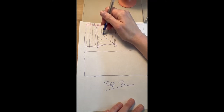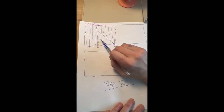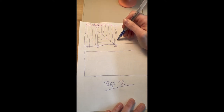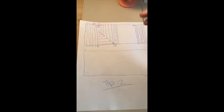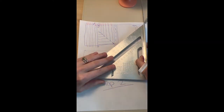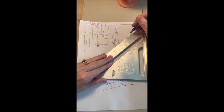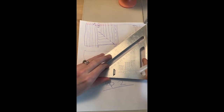Once you've figured out this section of the pattern it's all going to be 45 cuts — just a reflection. You're going to do the same thing just reversed. You'll have your four lines, then your two going back towards the middle, and then your other middle section of six facing outward. Once you have one section of the top drawer it's the same but reversed for the other side, and the same for your bottom drawer. I usually go through and number the pieces so I can keep track of the cuts, and I'm going to show you why — you can reuse the same cuts without having to re-figure it all out.